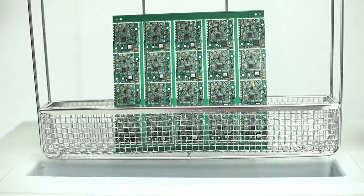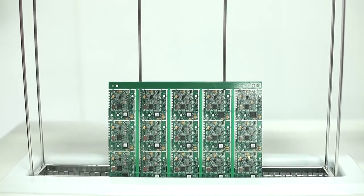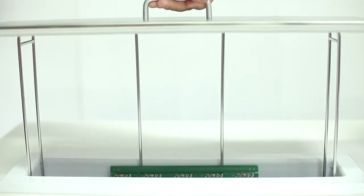With the redesign of the test cell, we focused on eliminating the possibility of false residue measurements as well as crafting a delicate handling method for assemblies. To accomplish these goals, we brought the test cell into the body of the Zero-Ion and developed a basket design concept which holds assemblies as they're lowered into the test solution, keeping outside contaminants from entering the solution during a test.